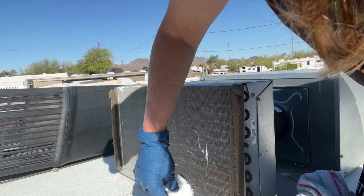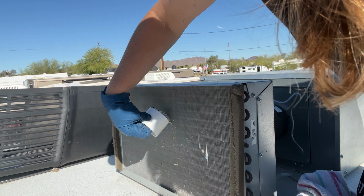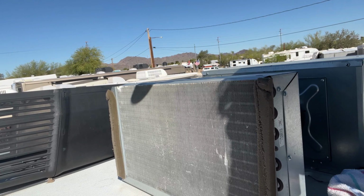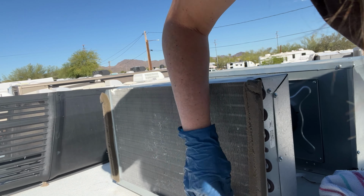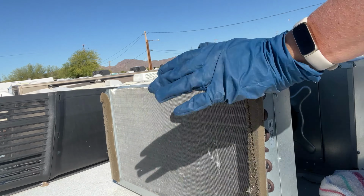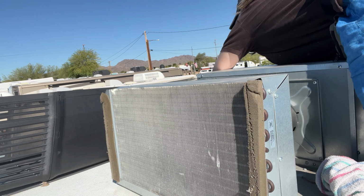I am now cleaning the other side of the air conditioner, cleaning the coils, but this area has a lot more dust and debris and hair on it, so I'm dry brushing it first with that cap. And I'm trying to straighten those coils there. You can see there's a bend in them, and I can't get it to straighten with the brush alone. Sometimes you can, but I have another tool that I'm going to grab from my bag, and I'm going to go ahead and straighten those coils out with that. I will leave that in the description as well, on an Amazon link.